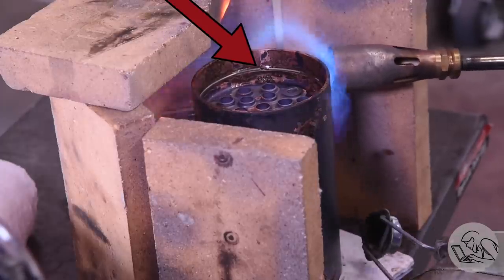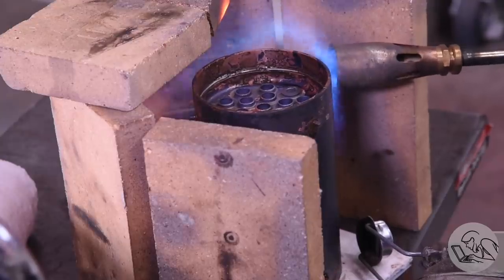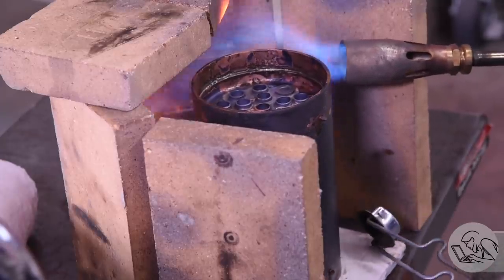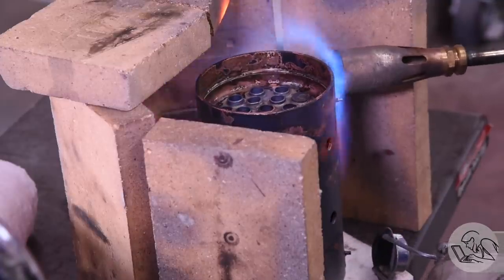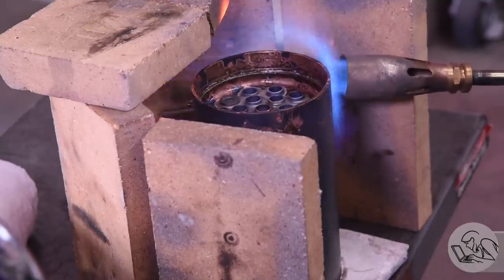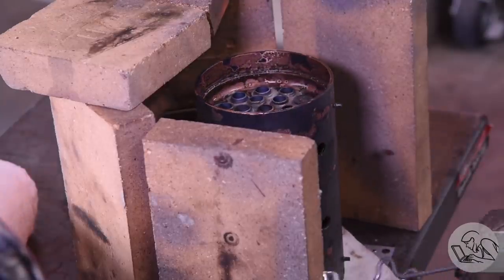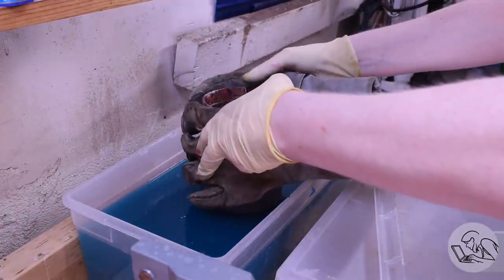Then the foam kind of settles down and turns into a clear liquid, and this is where the magic is about to happen. When that clear liquid appears, the silver solder is just about to melt. What you're looking for is that silver solder to dramatically flash into liquid — it's very obvious when it happens. Here's an example of that solder flashing moment right there. How it turns from wire to liquid mercury kind of instantly. Once I get an area flashing like that, I just kind of work my way around the neighboring areas, because once you've got that one spot hot enough you can just carry the heat around as you go. Towards the end it goes faster as the heat accumulates in the shell, so you'll see the entire back half of it flash all at once, which is very exciting. I'm only heating the outside of the shell — the whole point of silver soldering is that you want the joint or the metal itself to melt the solder, not the torch. Then once it's done, I kind of work my way around one more time just to make sure there's no lingering spots that didn't flow properly. Once the torch is off, another quick inspection all the way around. It's not too late to reflow something right now if it needs it. But it looks good, so I covered it up and I'm going to let it cool as slowly as possible to hopefully not stress any of the joints.